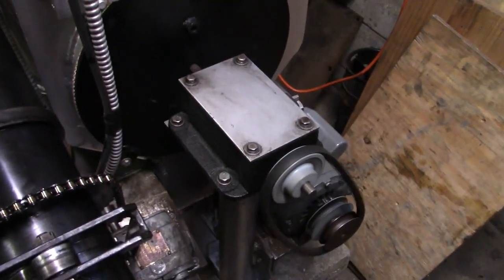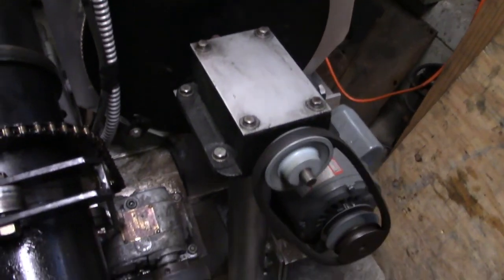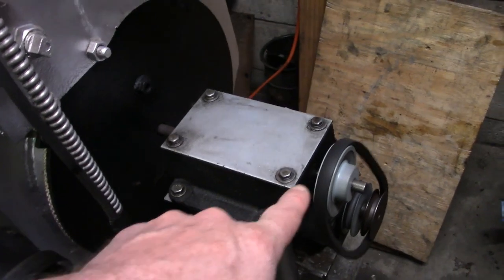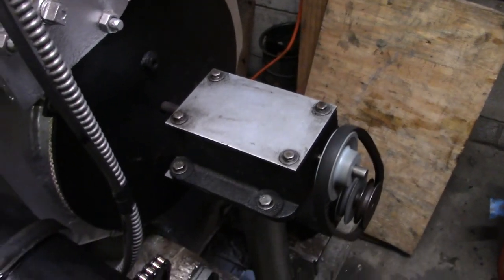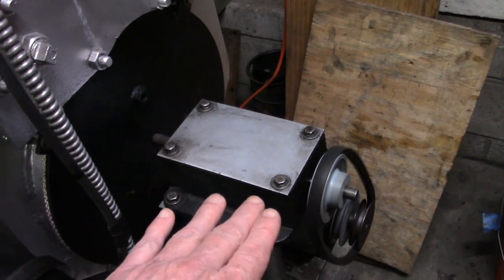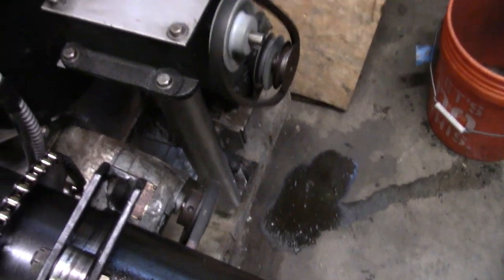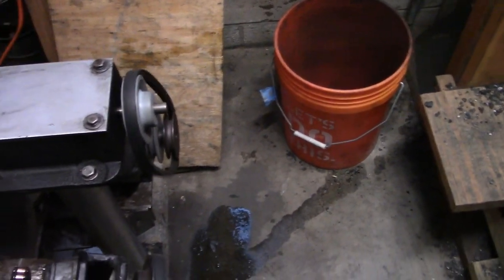The fan's running pretty quiet. Obviously I put too much oil in the bearing box. The important thing to remember about the bearing boxes is there are no seals for the shaft that runs through it, so if you fill the oil level up to that hole it's going to leak oil out when you start it up. But the nice thing about it is it'll just spit the oil out and eventually it'll reach the level it wants to be at.